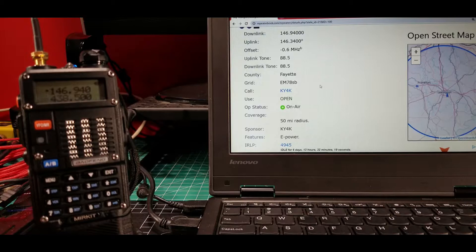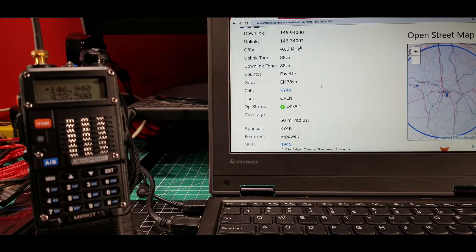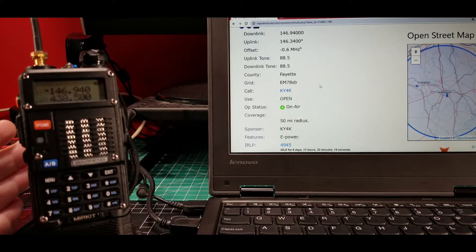We've got a few more bits of information to work on. You can see there's an offset — it has downlink and uplink, and the downlink is 146.340. A lot of two-meter repeaters use a minus 0.6 offset. So if you take 940 and subtract 0.6, it becomes 340. We also see there's an uplink tone and a downlink tone. Some repeaters don't use tones at all — you may see CSQ, carrier squelch, which means you leave that off. In this case we're going to use both tones.